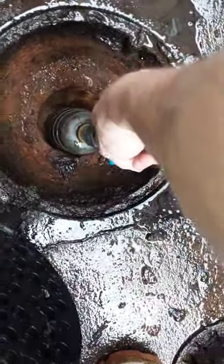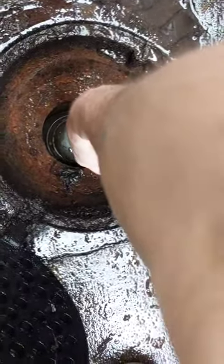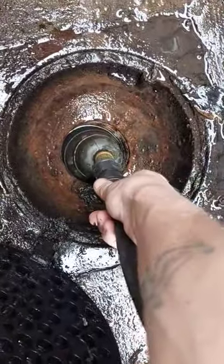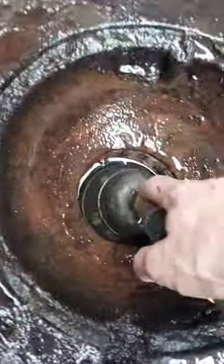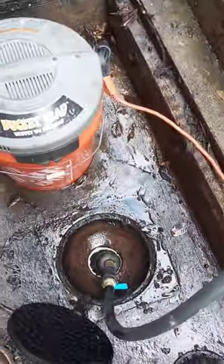You just want to give it some pressure, let it go ahead, and very slowly let it get to the form of that pipe. Then you can knock it down a bit and just let it do its thing. You got to be careful — you just can't crank it all the way up when you've got it in there, because it'll blow apart right here, and when that goes into the line you've got a hell of a problem.